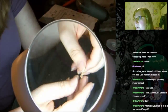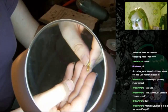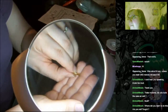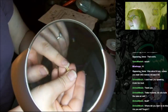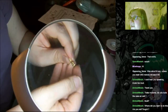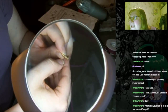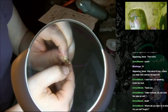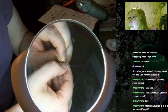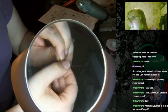This is one of the crimps we're going to use. They're very, very small crimps. Now, I don't know how easy it's going to be to see on the stream, but this side here is the side that connects to the spade connectors on the bottom of the button. This side here, you can see that there are 2 groups of basically bits of metal that crimp onto wires. The idea is that you use the outer piece to grab onto the sheathing to hold the wire still, and the inner piece connects to the core in the middle to make the connection.